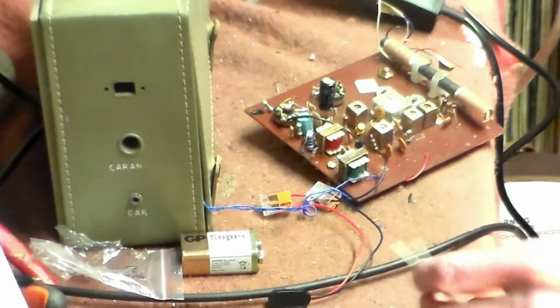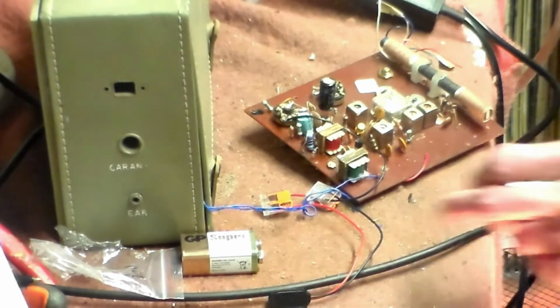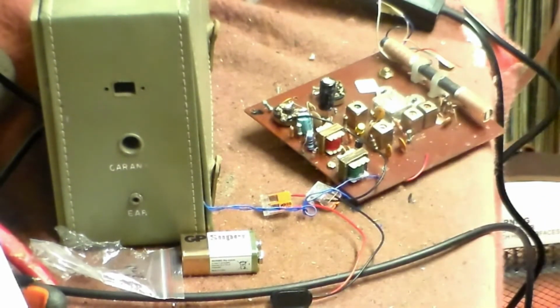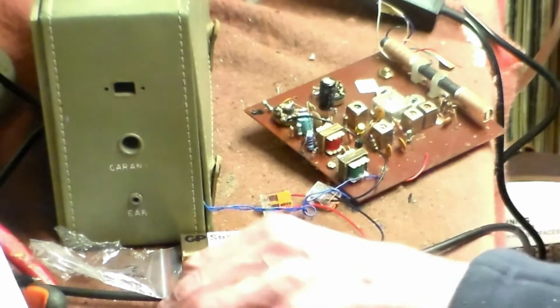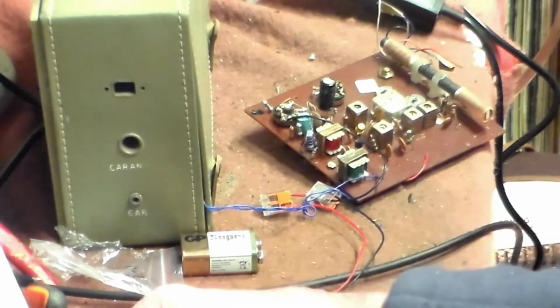Because of the AGC, this capacitor feeds RF off the AGC line to the deck, and without it you get all sorts of horrible voltages. So this radio is a bit closer, and then I've got to align it, which I don't think has ever been done with this, and hopefully then it will work. How it worked initially, I simply do not know. I really don't.